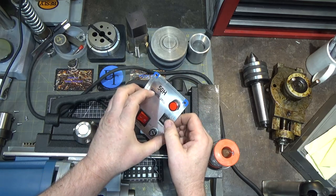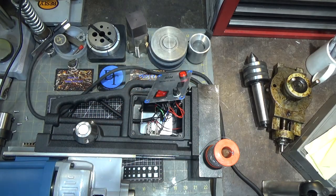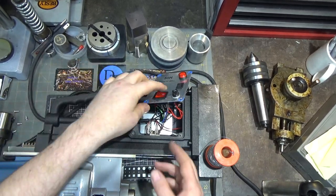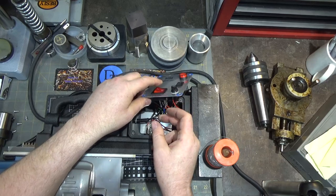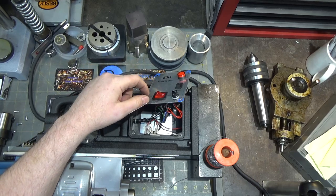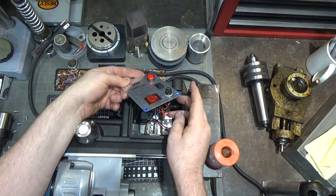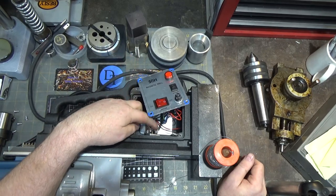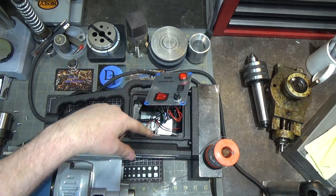Now when this switch goes on, the magnet will follow. Inside here it's a pretty simple device: you have AC coming in, power going to the drill motor that goes through the switch — rated 16A/250V or 20A/125V — so hopefully it'll survive the on/off of a motor. Inductive kickback tends to arc across switch contacts when switching big motors, which can easily damage them. On top of that you have the electromagnet, which is on the output of this switch and goes through a full-wave bridge rectifier right down here.